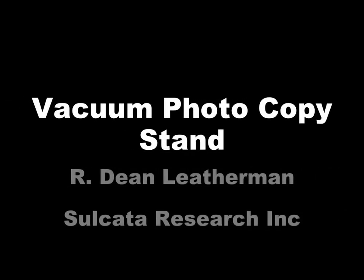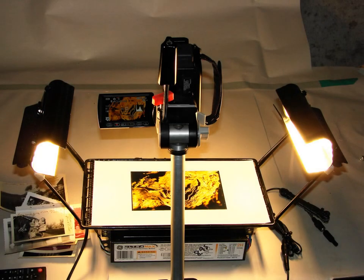I've documented the process where I designed and built a vacuum photocopy stand. In case anybody wants to build one — if you Google 'vacuum photocopy stand,' you won't find one. Most commercial photo stands are just a piece of glass. You put the photo underneath it, but the glass has internal reflections, it smudges, it takes time to lower, and contact between the photo and glass makes problems. This is the best way to do it, and you won't find it if you Google 'vacuum photocopy stand.'